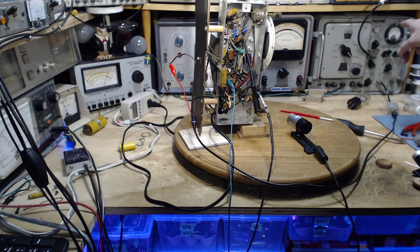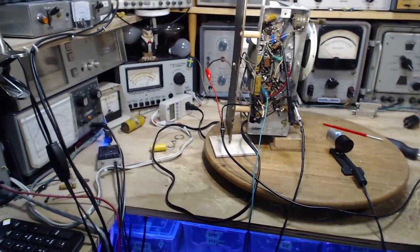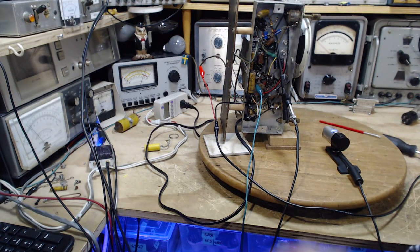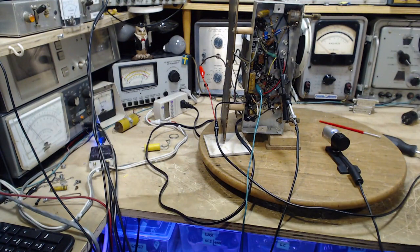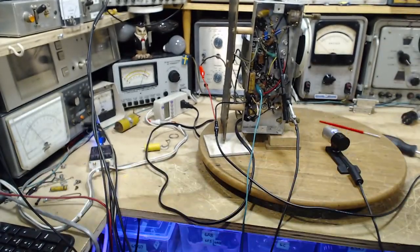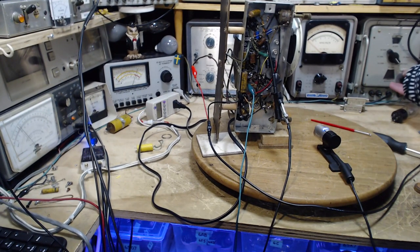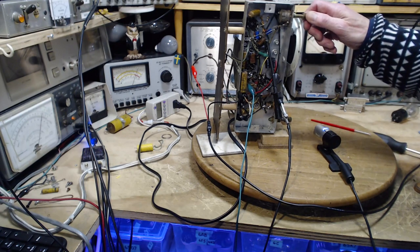It's not tuned - this is not tuned to this signal. We should do that. I'll move these wires out of the way - there, a little better. I'll tune the signal generator until we hear it come out of here. Let me turn it up so you don't miss it. There it is! Now you can see the AVC meter reacting - there's the tone.